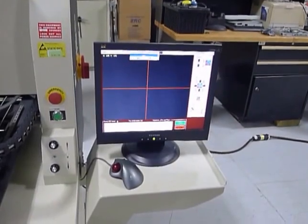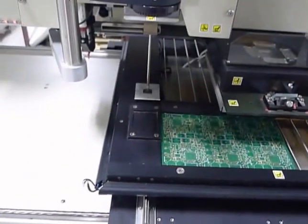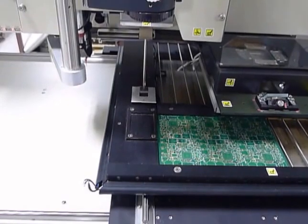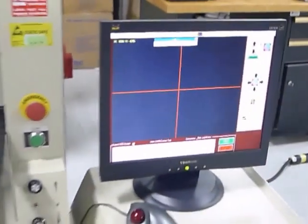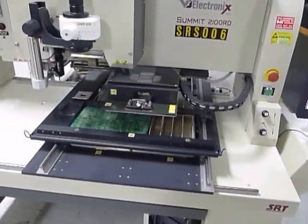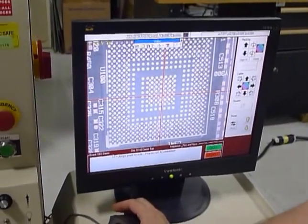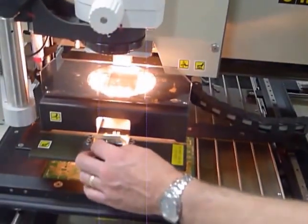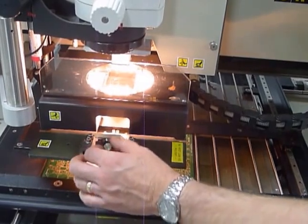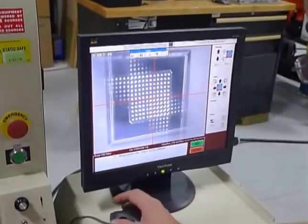It's bringing the component down to pick the part. Now it's going to shuttle the table back and the cube out. What's nice about this machine is the split prism — this is a picture of the entire part, which is very large. The split prism lets you bring the part in so you can just align the corners.